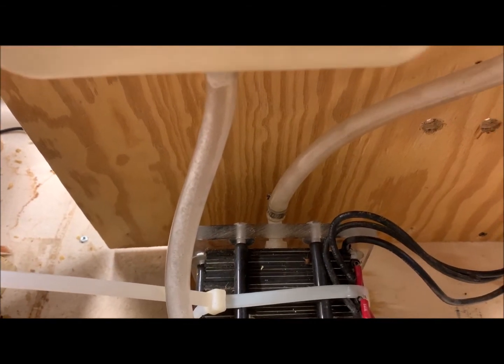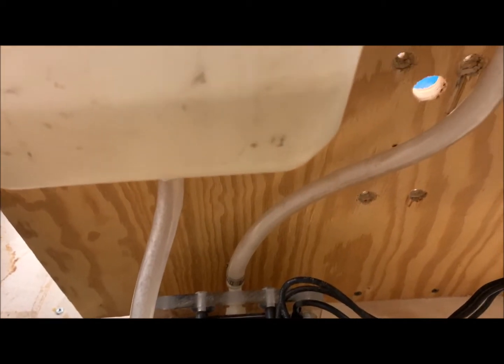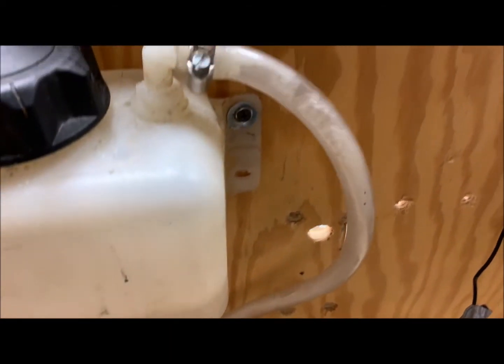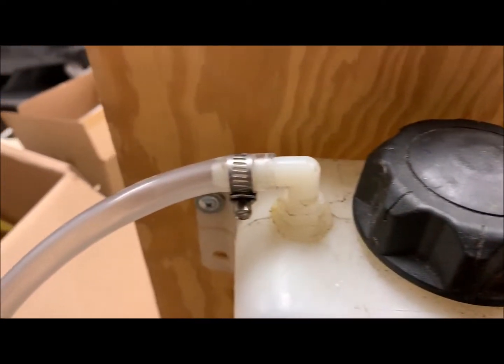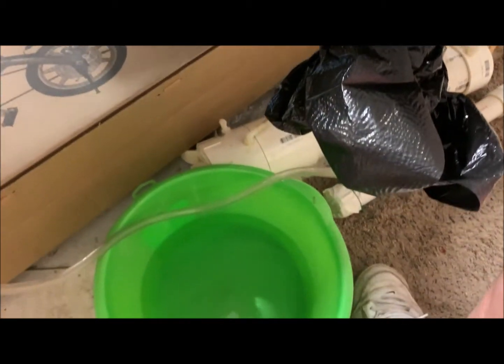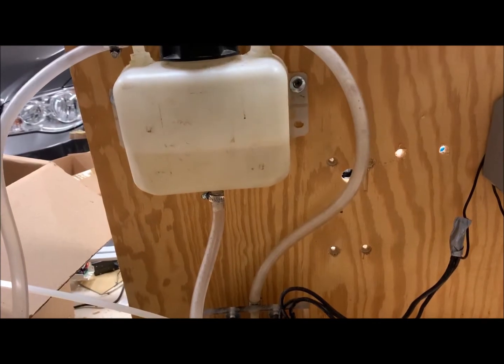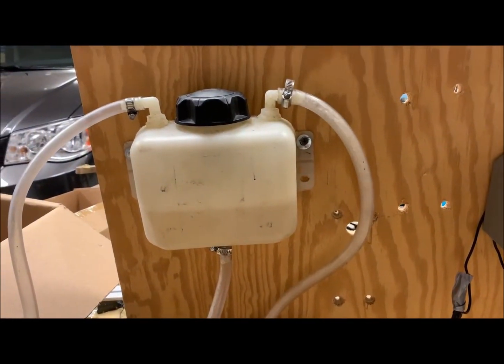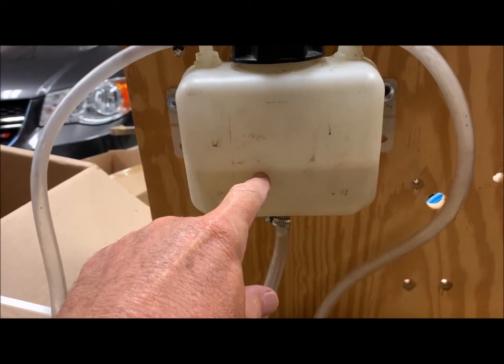The plates break down the water molecules into hydrogen and oxygen gas — two hydrogen to one oxygen, H2O. This shows the generation power, and you get quite a bit. Normally I have that going down a line into a water bubbler, but I decided to try to inflate a plastic bag, so I have the line going into this bag. You can see it pumping through, showing the level of electrolyte I have.